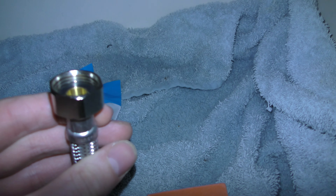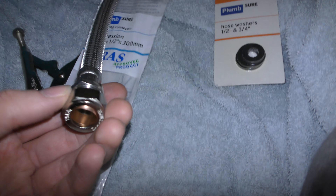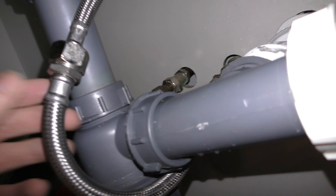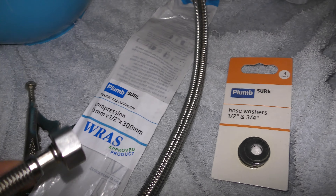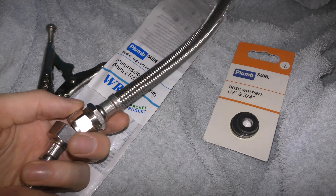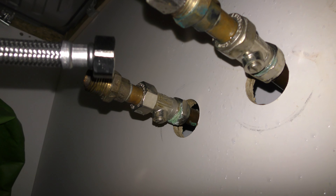It looks like this. You've got one end that will go straight into where the mains water is going out, and you've got the other end that you can connect to the tap. So we've just joined them together and it's really easy to do. Here's our flex pipe - that will go into the tap, and that goes immediately into this other one. We've just put an extra washer so it doesn't leak, and we've got some waterproof silicone. And then that bit there on the end can go straight into the hot water. It'll go straight into the hot water, and then you're done.